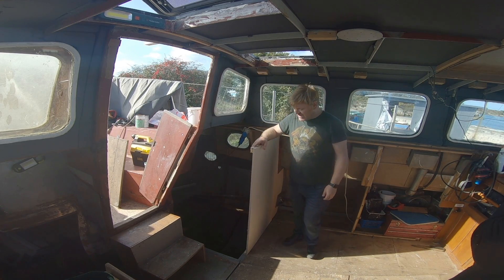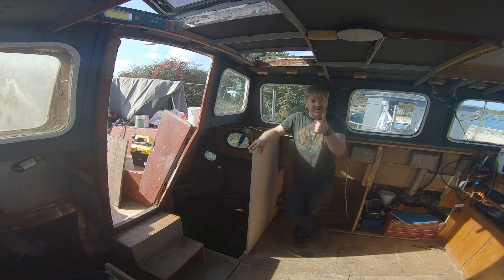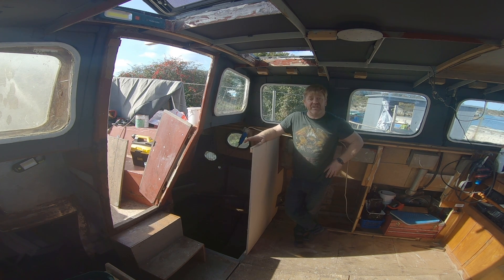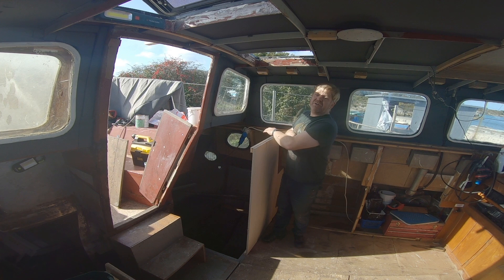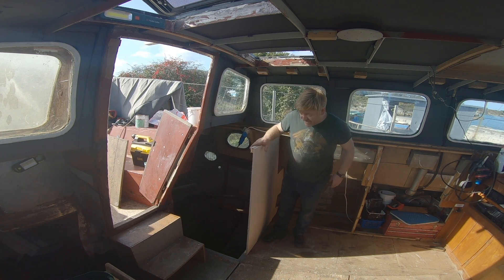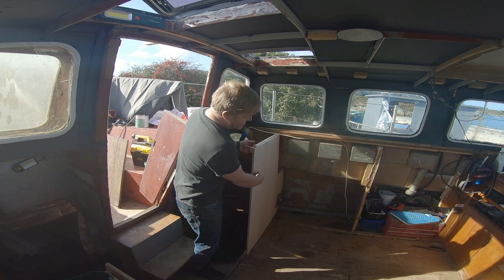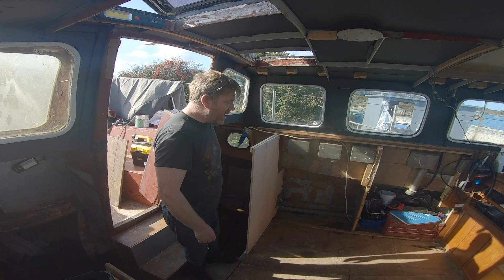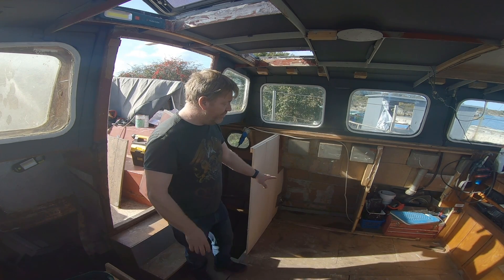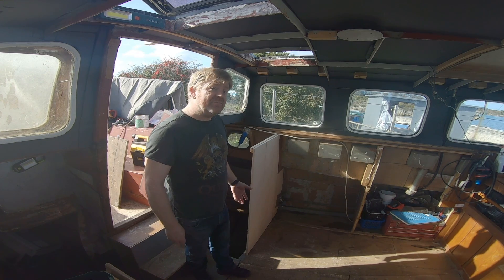So this little wall thing here is in. It's knocked together out of some off cuts of birch ply that we got off a friend — thank you very much, you know who you are. We may make this out of solid pieces once we've decided if we like the design or not. I'm going to be using some spruce and some mahogany and some sapele and some teak to trim all of this. But this is good quality birch ply, so that's going to be the little bulkhead wall. Access down to the aft lazarette is going to be there. I'm going to round this corner off of course and trim it and everything. So the next thing today is to make the boxes for the seats that we're going to put in the dinette — see how we like the look of them.